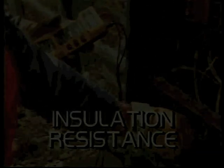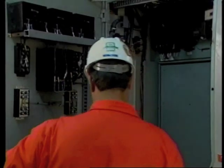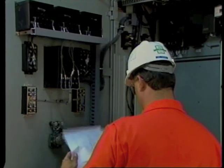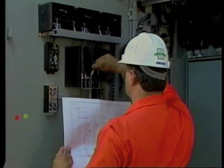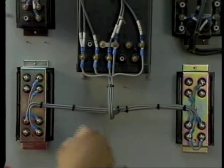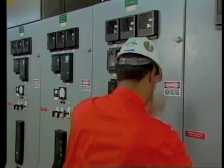Once the transformer has passed the visual checks, you can begin the more detailed testing and inspection. With other types of electrical equipment, the safest and most logical place to begin an inspection is with a visual check of the equipment's general condition. Look for broken or corroded parts. If the equipment includes oil-filled transformers or breakers, check for leaks. Listen closely — buzzing or rattling sounds can indicate loose parts. Compare the equipment nameplate with the latest copy of the one-line diagram.